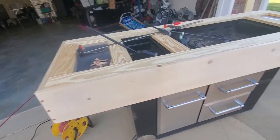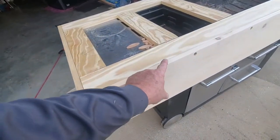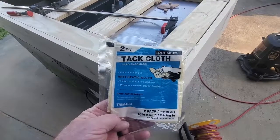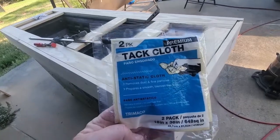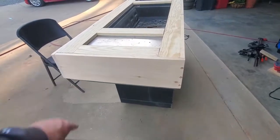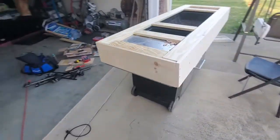I've got it together — it's not glued yet. Remember, if you sand, go with the grain. I got the front sanded down and level-checked with a speed square to make sure it was flat all the way across. After you sand, use a tack cloth to get rid of the dust. I didn't run my screws in all the way because I need to take it apart and stain everything. There it is in finished wood form — no stain, just natural white pine, not too bad.